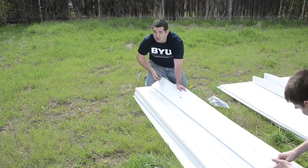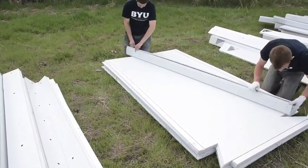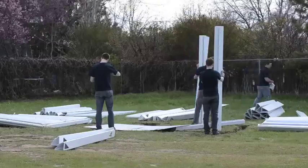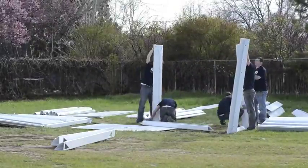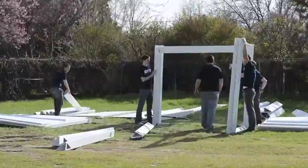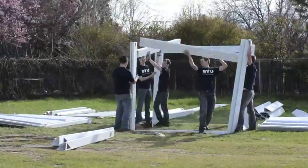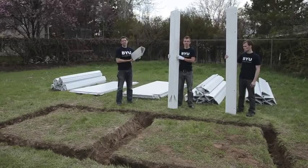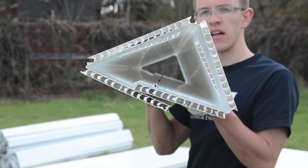We can make a solid beam out of a flat panel. If I want to build a house in the United States, I'll use a big pile of 2x4s, 2x6s, 2x10s — plus subflooring, sheetrock, and all these different kinds of elements. Under typical construction in the US, almost every piece is custom cut, meaning you end up with many, many different types of elements. What you see behind me is just 5 elements plus a connector, and these 5 elements all come from one sheet of raw stock — a 4x8 sheet of polypropylene.